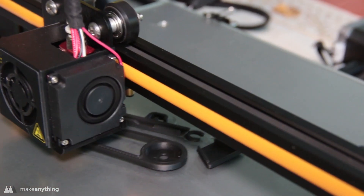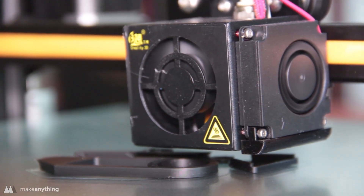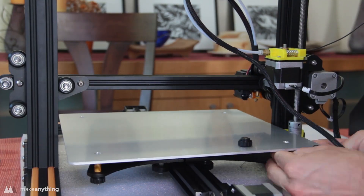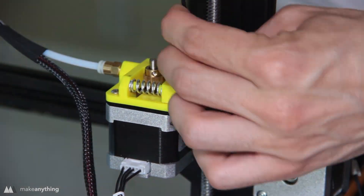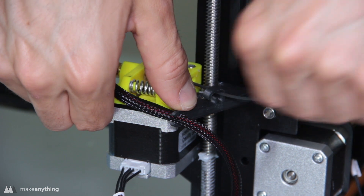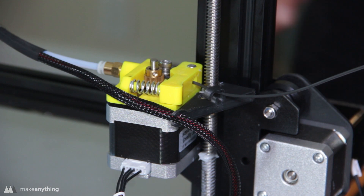This machine can print big, but I also wanted to see if it can print several small parts in one go, so I printed out these modifications for the CR-10 itself — another wonderful print. Here I am installing those modifications: the first is a strain relief for the wire of the heated bed, which people have said can fail, and then there's a little attachment that guides the filament so it doesn't touch the greasy Z-axis rod. It's probably a good idea to make these modifications some of your first prints on the CR-10 — I'll have a link in the description so you can download them for free.